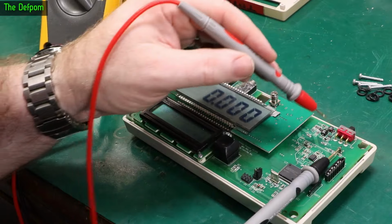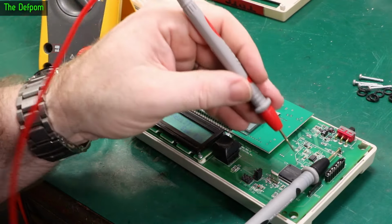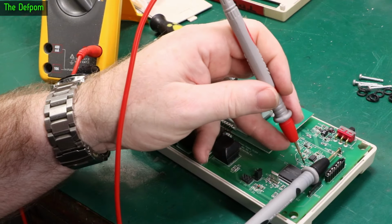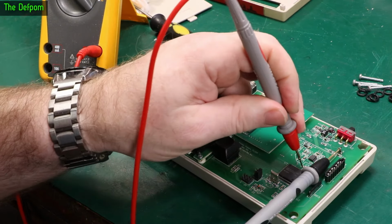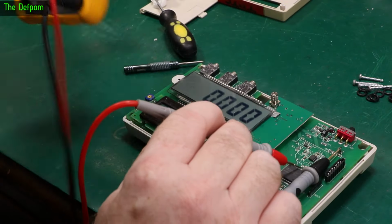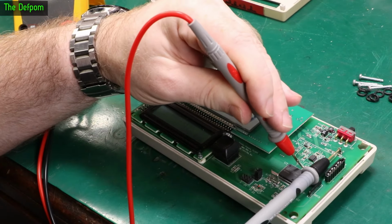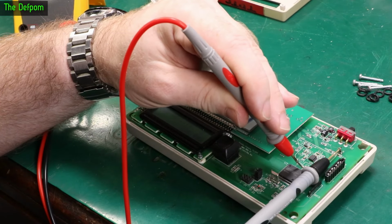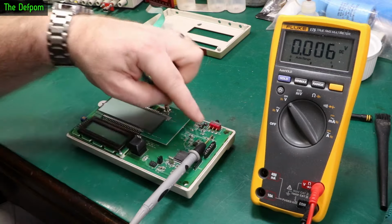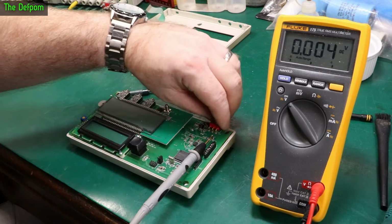So I'm now looking at the switching converter here. It's a boost converter. If I probe onto the input power supply to the microcontroller, just here, I'm getting 5.4 volts right now. That is working. Now I'm just watching the voltage. It is gradually dropping down, which is interesting. It's sitting at 5.4. I'll show you this on camera. I've got the probe looped through the convenient little loop on that battery terminal, which is 0 volts.